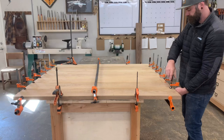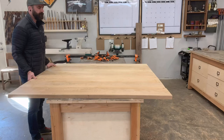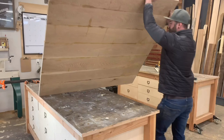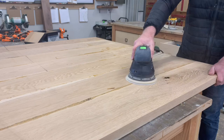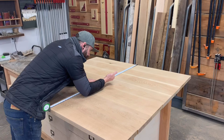With our table legs done, it's time to set those aside and focus our attention back onto our tabletop. Since we're going to be cutting this tabletop into a circle, the first thing we're going to want to do is flip over our table, as we'll be doing all of our cutting from the bottom and not the top. The main reason is that we'll be using a circle-cutting jig with the router and we're going to have to put an anchor point in the center — we don't want that pinpoint to show on the top. I like to take a putty knife and scrape down any of the glue squeeze out, and then sand the bottom thoroughly so our router jig won't get caught up on any of those seams.